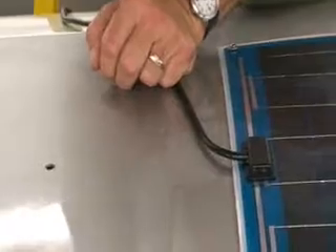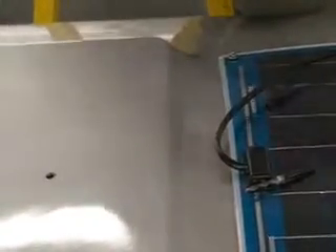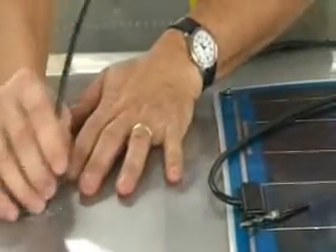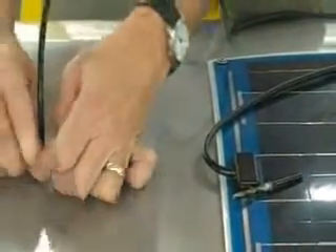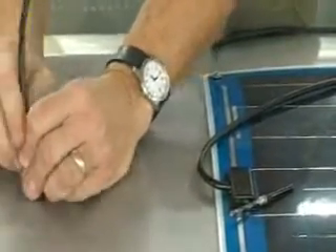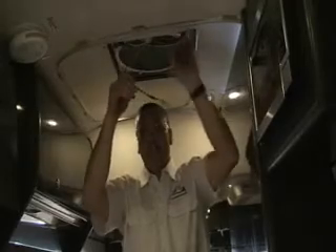I blew my dust away. Now I've got a grommet — a little quarter-inch grommet that's going to fit right over this end. I've already cut the end off; that grommet's going to fit just right over there. I'm going to put it down in my hole, then go on the inside and find my wire. Now I'm coming back on the inside — I'm just going to lower this down, reach up there, grab my wire, and pull her right on out. These two are going to get connected by cutting and joining them, but we're going to do that later. For now I'm going to go back and make my connections in the back where the wires run down the wall to the controller.